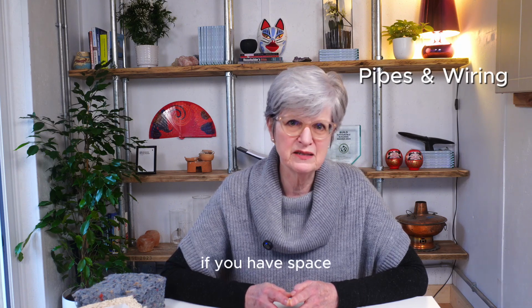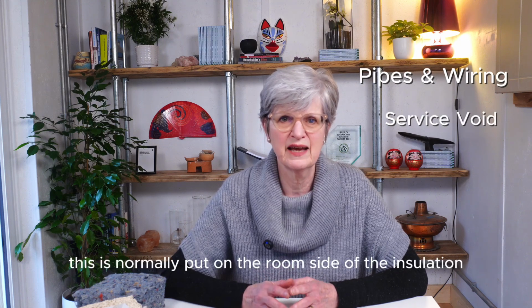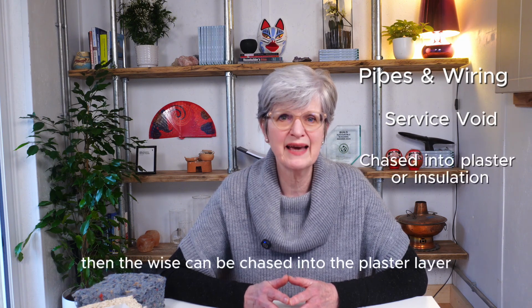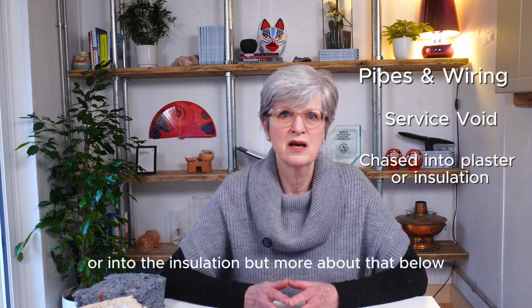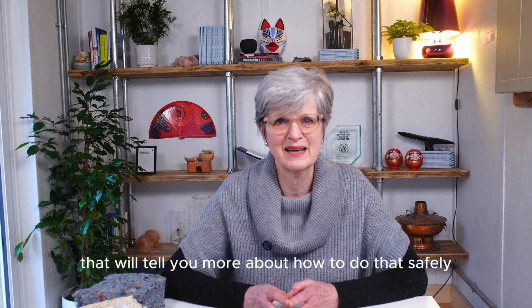If you have space, you can build in a service void for the wiring and the pipes. This is normally put on the room side of the insulation and save you having to have breaks in the whole system. If you don't have the space to do that, then the wires can be chased into the plaster layer or into the insulation, but more about that below. And I'll also put some links in the description that'll tell you more about how to do that safely.